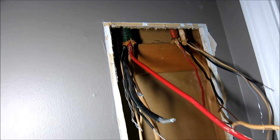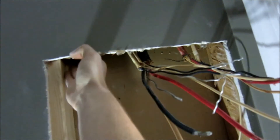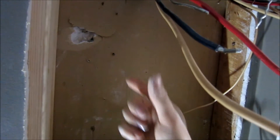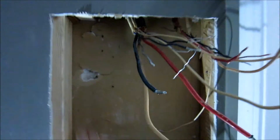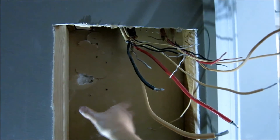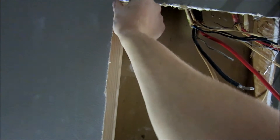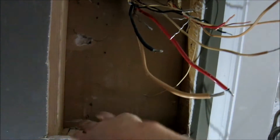As you can see, we had to cut and then I put a longer piece of 2x4 right here, and used a piece of that wood to space it out. Now we've got enough space to fit the new panel in — the new one is four inches and the old one was about two and a half inches so it wasn't going to fit the same way. Now that I've got this a bit bigger we'll put the new panel in, do some drywall — who cares, you're going to expect something like that anyway. I've got a stud right here, so I just cut a piece of drywall, put it in, mud it, and done.